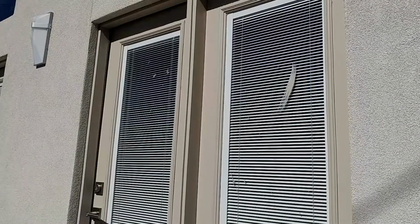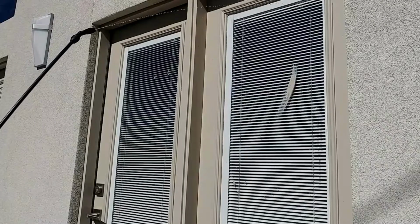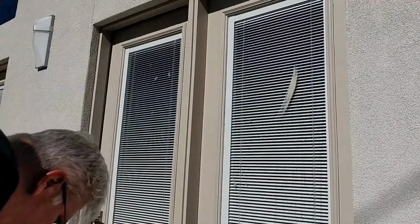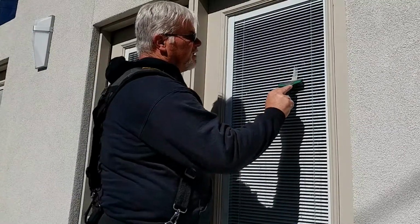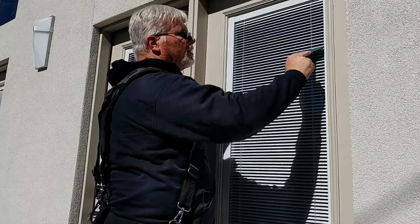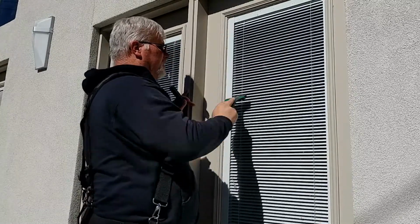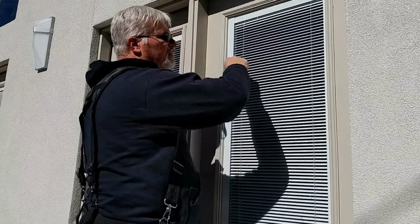First things first, always make sure you use plenty of window cleaning fluid. In mine, I have a tendency to use Dawn, and this time I am using some Glass Gleam 4. My first step is to use a 4-inch razor blade. This gets off the bigger stuff, such as paint drips, overspray, and some of the things we have here in the Southwest called stucco, which is a form of either concrete or a latex spray.